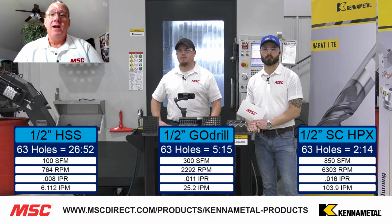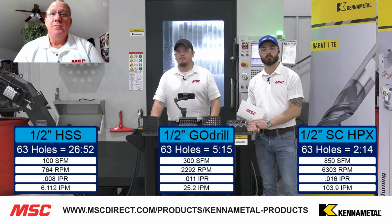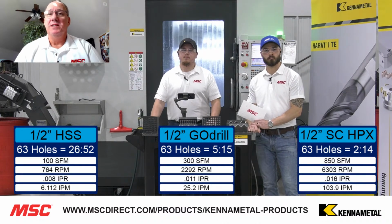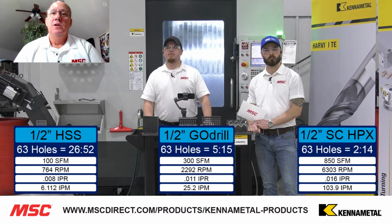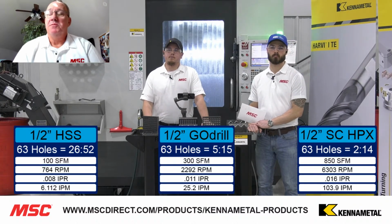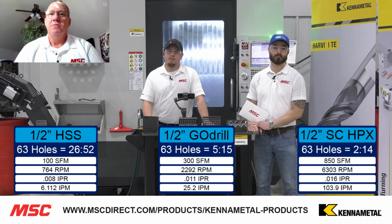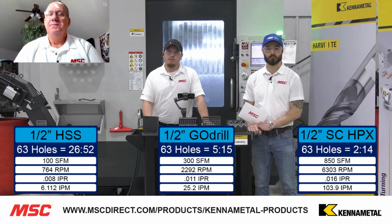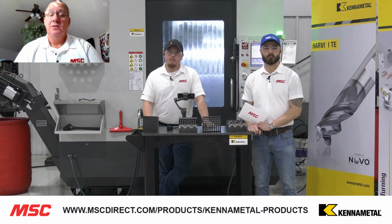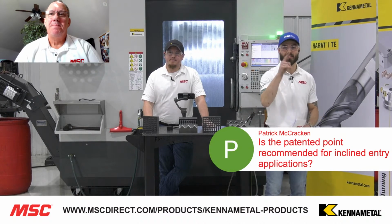So when we think about increasing capacity, if you're drilling holes, it's something that's sometimes overlooked. If it's a onesie, twosie type, people just go grab a high-speed steel. But even at that, if you look at 26 minutes to 5:15 with the GOdrill, all the way down to 2 minutes 14 seconds with the HPX drill, time's money, as we discussed. So freeing up that capacity, getting more parts across your machine, that's what it's all about. So everybody, if you're drilling holes, you need this drill. I like it. If you're drilling holes, you need this drill.